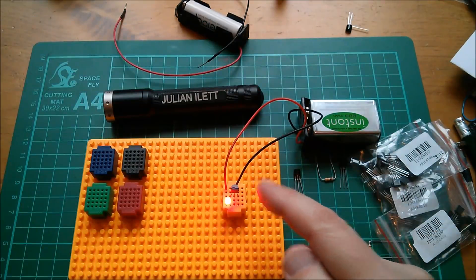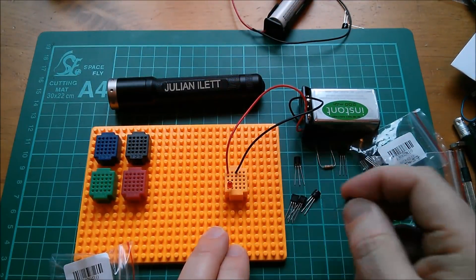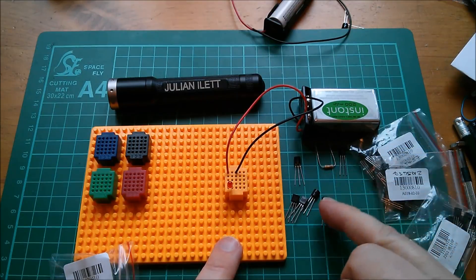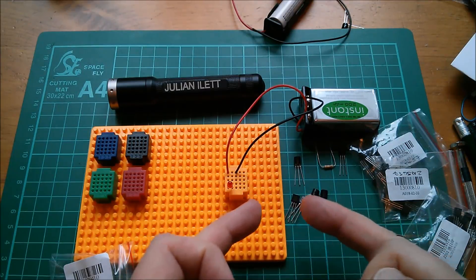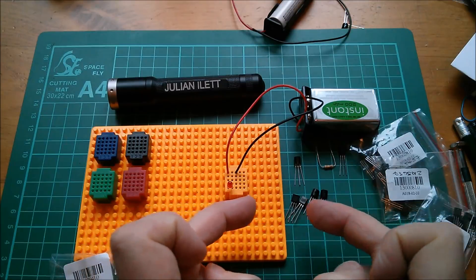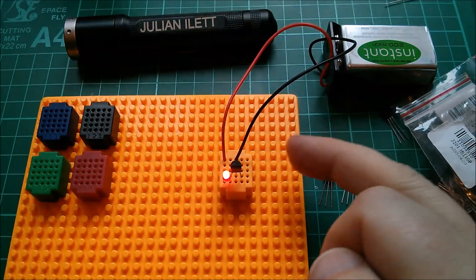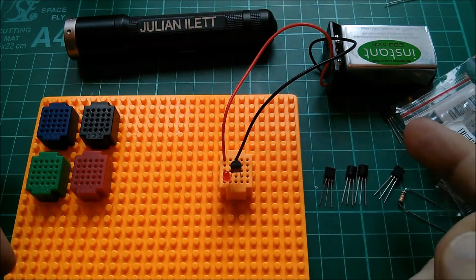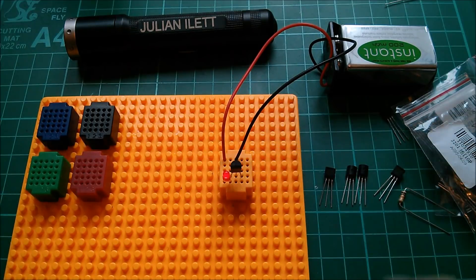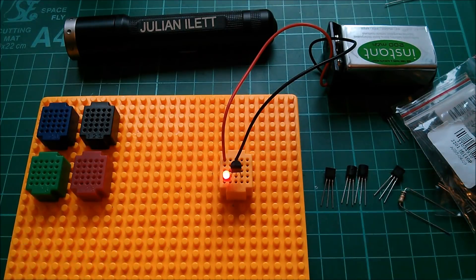This one doesn't cut off at 1.2 volts. I've been through a few of these and they all seem to behave roughly the same — this J112 seems to have a wider channel for current to flow, but by the same token it takes more voltage to widen the depletion regions and pinch that channel off. So yes, these are strange and interesting devices — these JFETs with their electric field sensitivity. I'll come back to playing with these devices when I've done some more experiments; apparently they make very good current sources. But for the moment, that's it — cheerio.